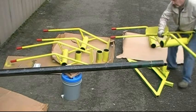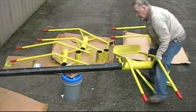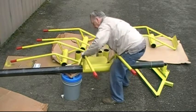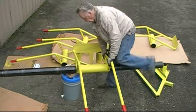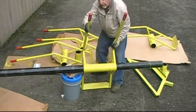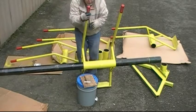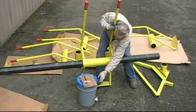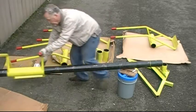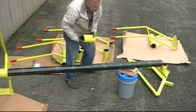So we simply pick this up and slide it down to the opposite end. As I get to my supporting structure, I can lift it up and slide it. Or a simple way to do it is to use the foot pad as a lever, lift the axle up — do this very carefully — move your support structure to the opposite side, and then slide it the rest of the way down. Slide it all the way until it meets the pivot. Put a spacer to follow.